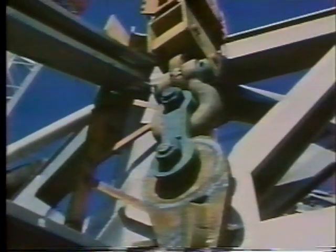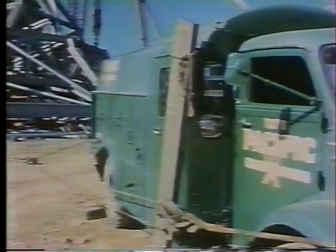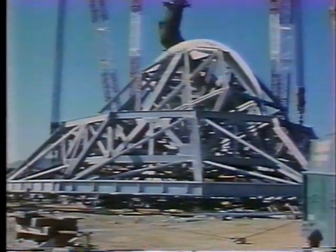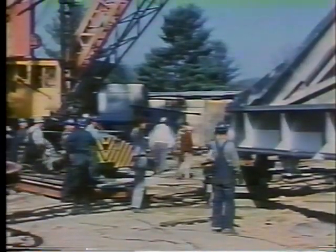Pickup location is of prime importance to divide the load between the derricks. A calculated unbalance has directed their placement in the structure. The falls are shackled to the load. The winch truck is rigged to hold back, and this 210-ton structure is lifted 2 feet free of its support cribbing.